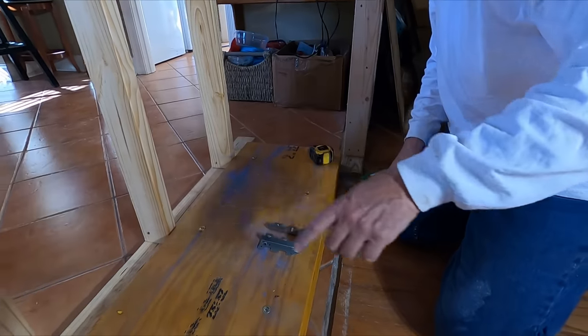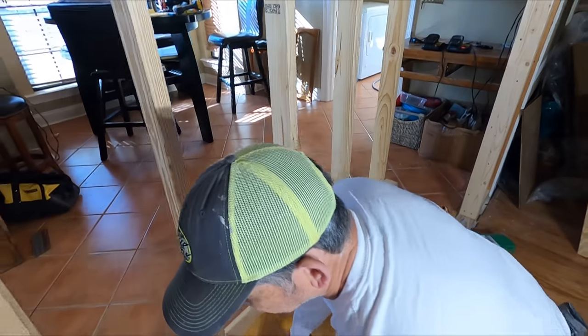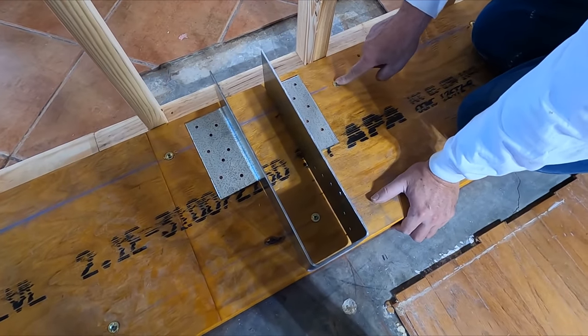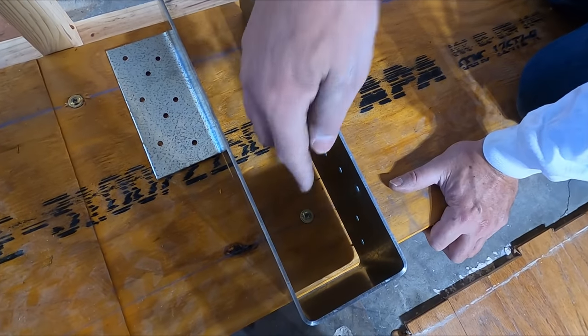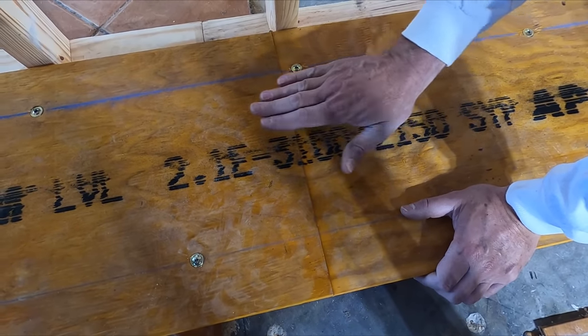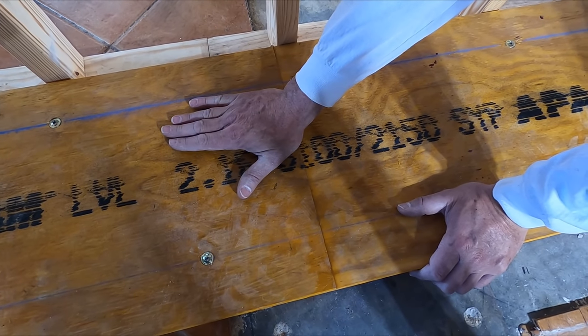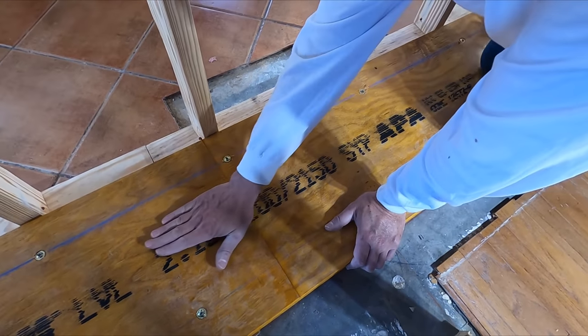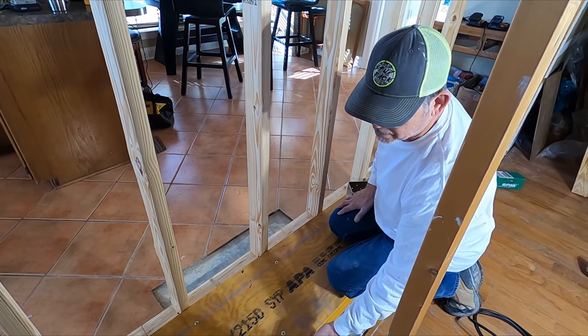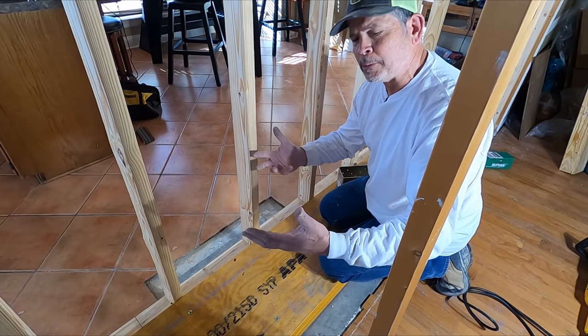And then if you come on down here to my left, you'll see we even planned it out for the big guy. And we're fine. We got a screw here, one here. That one gets covered. And then if you see right here, what you're seeing is a splice in the top lamination of the beam. Obviously, this can't be one sheet. So they're spliced together. And then the splices, I think, are a minimum of 8 inches apart for maximum strength.